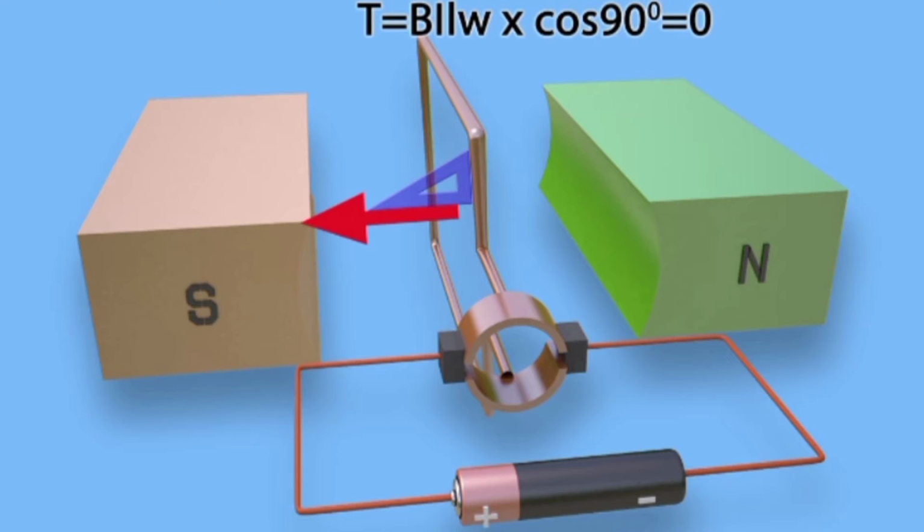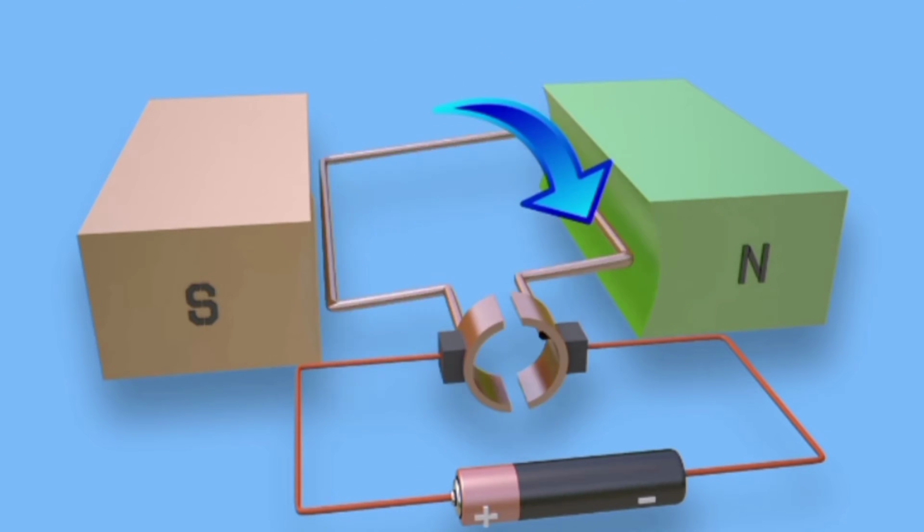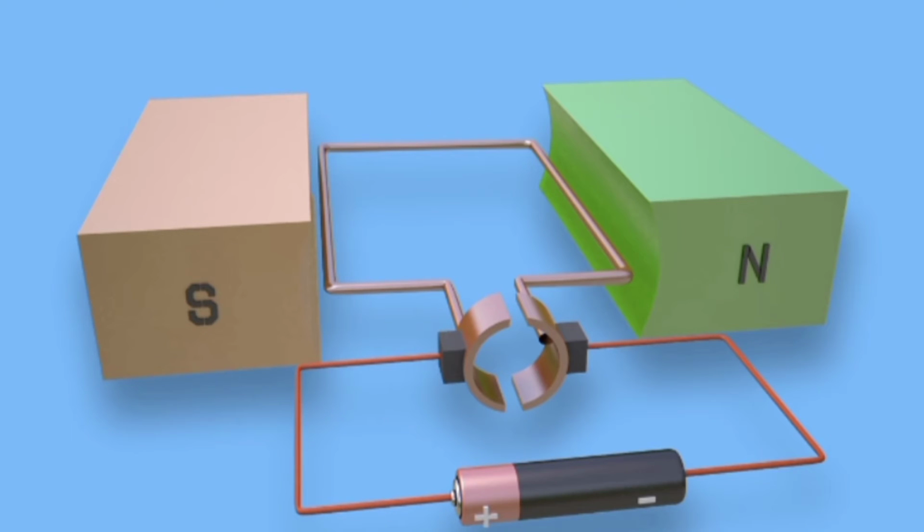After rotation, the turn comes to a vertical position with respect to the magnetic field. At this position there is no current in the conductor because the turn, conductor and brushes rest between the two commutator segments. Hence, there is no force acting on the conductor, but due to moment of inertia, the turn continues to rotate and comes horizontal again. The position of the conductors has been changed here. That means the conductor which was previously in the left position comes to the right position, and the one which was previously in the right position comes to the left position.